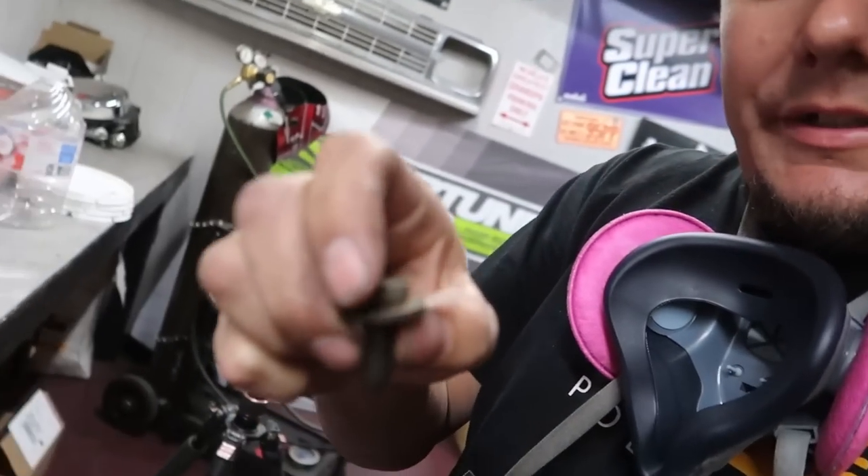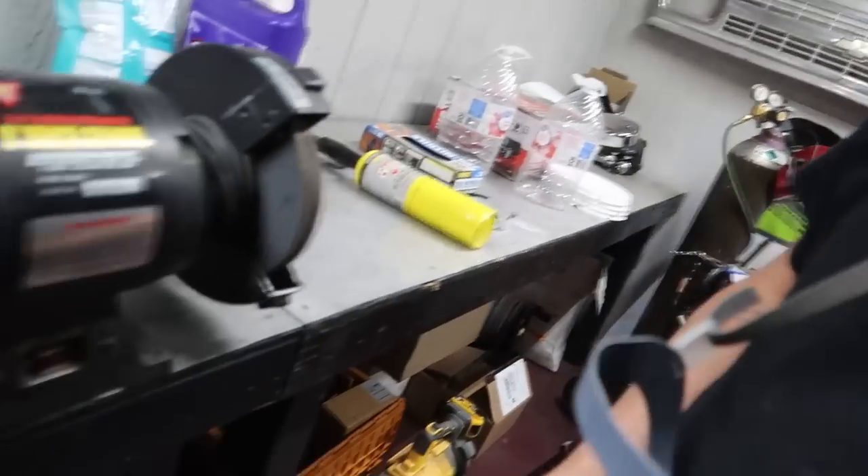I got three bolts — basically just fender bolts from the Blazer. They're really dirty, rusty, and old. First step is to get these things really clean. The shinier you get a bolt, the better the zinc coating is going to look. When I was building Khaki, I took all my old bolts and hit them with the wire wheel which made them really shiny, but the problem — which I didn't know back then — is you are removing all of the factory zinc coating that's on there, the only thing protecting it from rusting. After a couple of months, all those bolts I wire-wheeled were completely rusted out. I had to go back, wire-wheel them again, and clear coat them all.